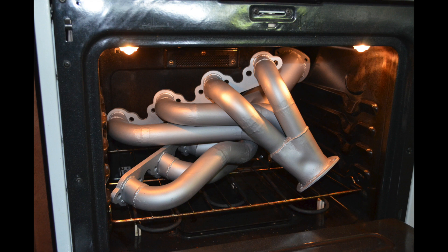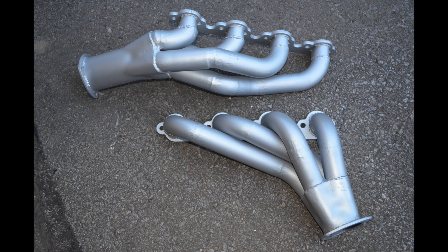Finally, you can use ceramic coating — you can spray the headers with ceramic paint and bake them afterwards. This is how they look when completely finished. Honestly, I wouldn't do it again with ceramic coating. The first time I did headers I coated them, but after the next time I didn't coat them at all and after four or five years they still haven't rusted, because the header kit uses aluminized tube so it doesn't rust.